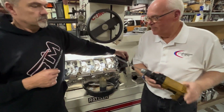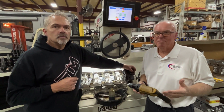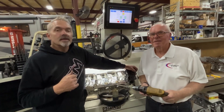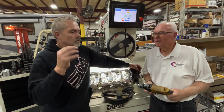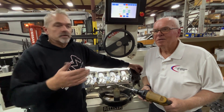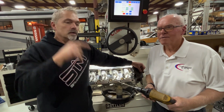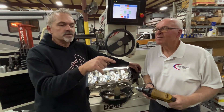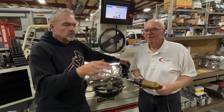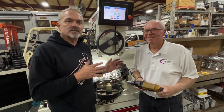The new tool is this diamond plated reamer. You run it through there exactly like you would the carbide reamer and it should only take a few seconds to get you to within a tenth of finished size, and it will repeat to a tenth consistently. The consistency part is what's nice. Once you have the diamond reamer sized properly, you just go through the same procedure every time — take it out, check it, done. These carbide reamers are also incredibly sharp; they cut like butter. Let's show you exactly how this works — it's probably taking us longer to change the tools than it is to actually size the guide.